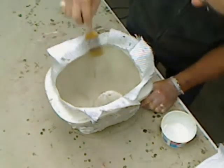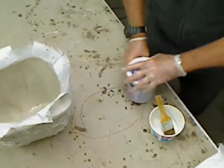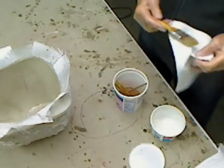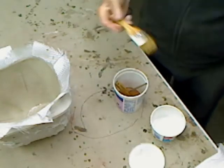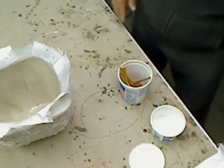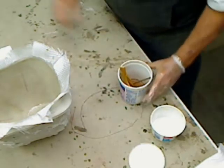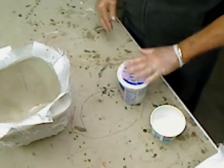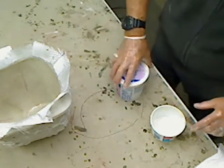That pretty much looks like the first layer is on. Now I'm a bit of a miser on brushes — they're not very expensive, but I take my brush and clean it with acetone. This is the same brush I've used on all the layups on the Starship so far. I cut them short so they fit in a yogurt container with a lid. The brush sits in a little acetone, the container stays completely sealed, and that brush will stay soft practically forever. So I just use the same brush over and over again.